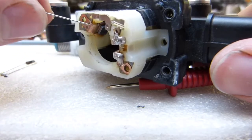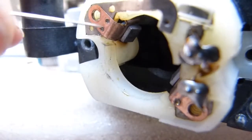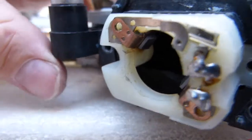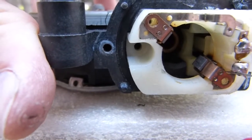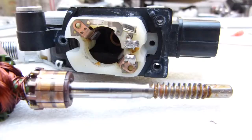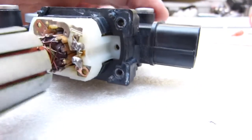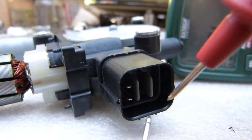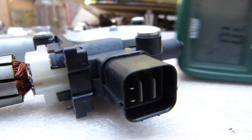This is not spring-loaded. This is a bent piece of copper plate — there's no spring. It's just the thickness of the copper being springy and hoping that it pushes the carbon brush into the commutator enough for sufficient electrical contact. This one flexes forward and can be bent forward much the same way. So when I put them together we will have resistance and we will have continuity as it should. 25.4 ohms — yes, I have continuity from pin to pin. I am certain this has been fixed and if I connect it to 12 volts DC it will run.